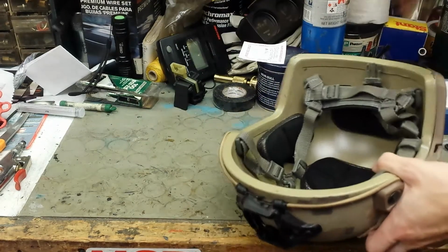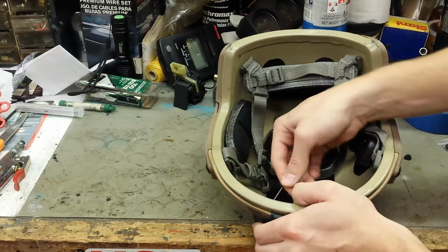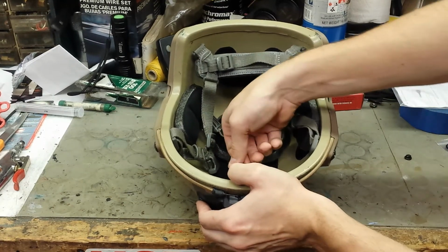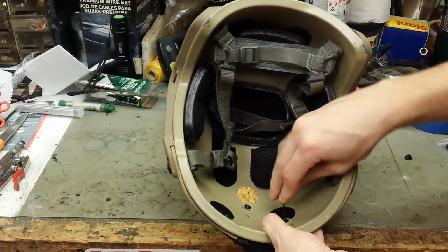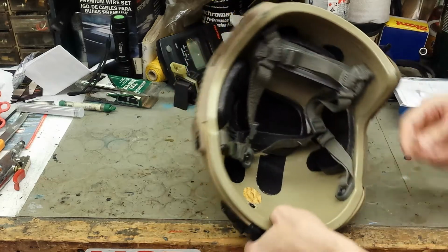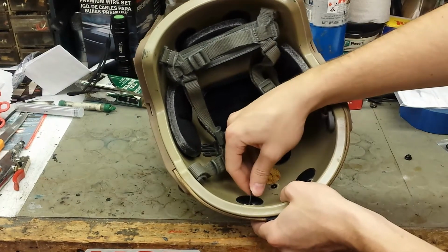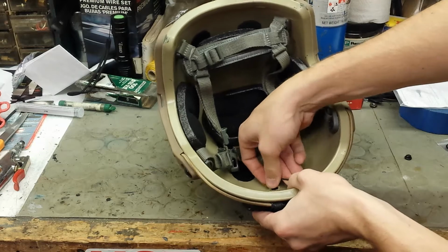So what I'll do now is I will go over each one hand tight, like so, just to the point where I get to a decent amount of resistance. Sorry if you hear a whining noise, that's just the lights above me so I could see my work area. So once you have that done, go ahead and turn it so you'd be grabbing the long side of the Allen key, and give it a 1/4 turn, or a little more, depending on how you had it tightened before.